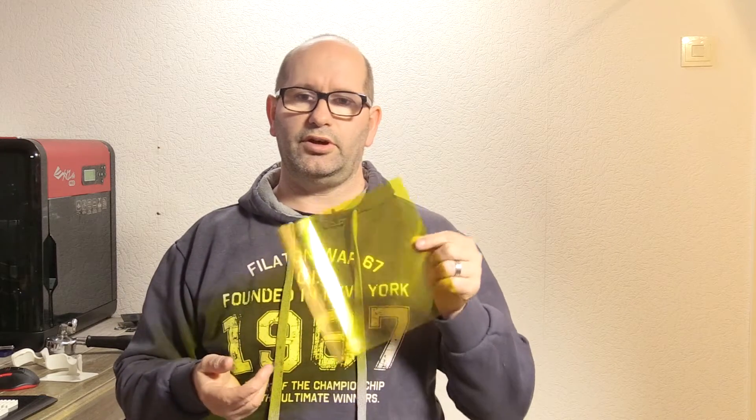Another thing I learned: you don't always apply new glue — you keep the same glue over and over again. You can smear it out with little paper tissues over the tape again and again, and the same glue works for about 10 prints. But after a long print your print can break loose, and almost every time your print is not very flat on the surface because there are blobs of glue everywhere.